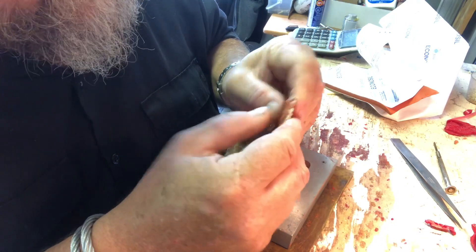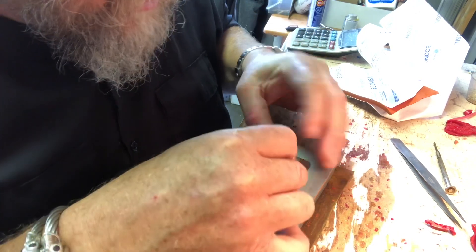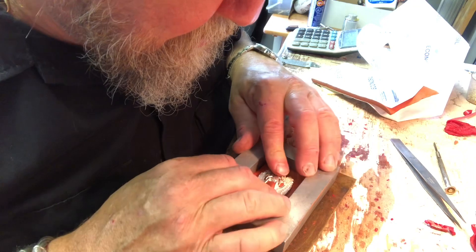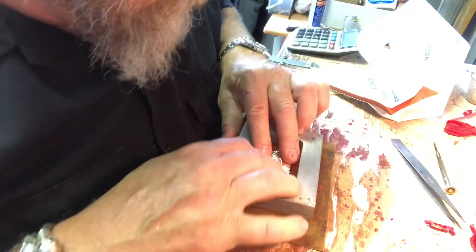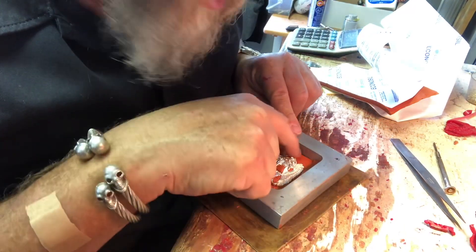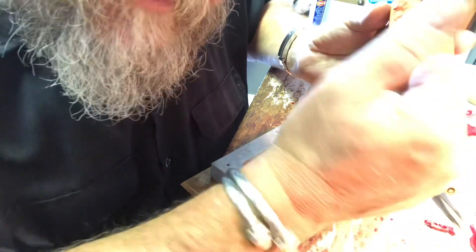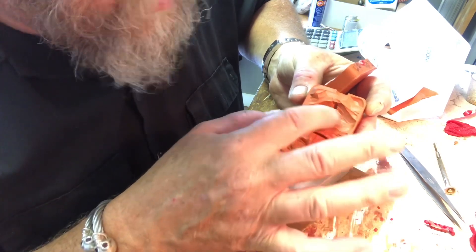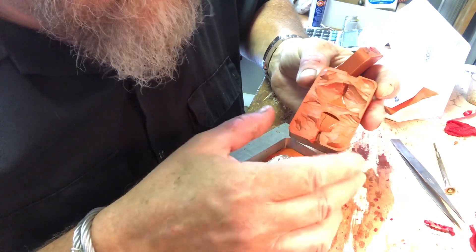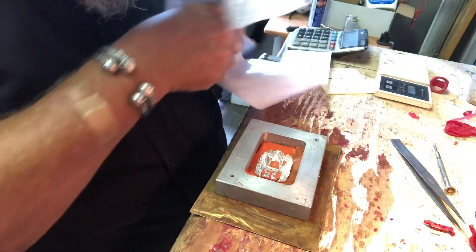This could be any piece you're working on — I'm giving you an idea of how it goes. I'm pushing it right through. Get that centered nicely — look at that, that's nicely centered. You can actually move it up a little bit. You want a little bit more space down at the sprue, because that's where the nozzle goes for the wax injector.